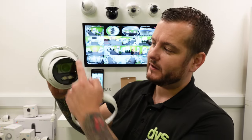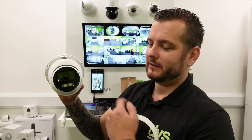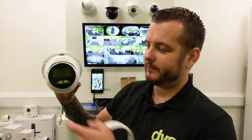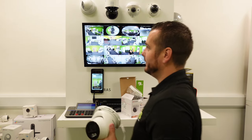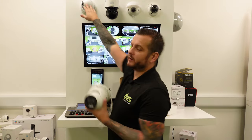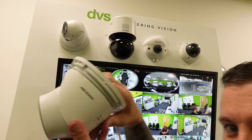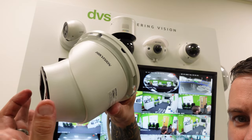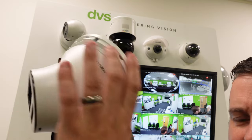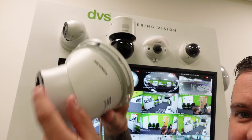It's a 2.8 or 4mm fixed lens, 8 megapixel, f1 super aperture because it's ColorView — we need to let all that lovely light in to give you that vivid 24-hour colour image, plus the white light bar. The body is more elongated on this model — a more elongated nose because of the chipset and the super wide aperture needed to fit into this turret housing, which is why it took a lot longer than expected. We needed to elongate that body.